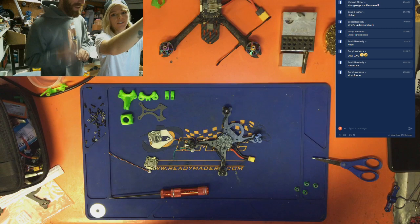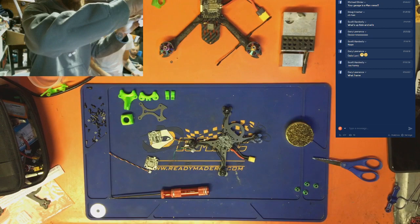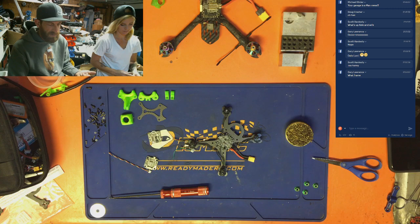Alright, let me show you how to solder these joints. Now, full disclosure, I re-tinned the leads on these things. You good? Can you see? Okay, so I've pre-tinned the leads, or re-tinned the leads, because all of this stuff pretty much came off of something else. And I went ahead and put on the battery lead because it's a little more difficult to solder thicker bunches of solder.